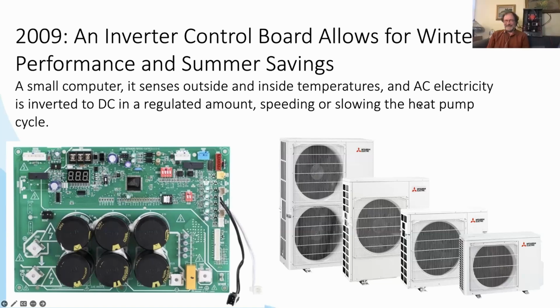There's no reason they need all that hot water. I have a 30-gallon heat pump water heater that was given to me, and I put a low flow 1.5 shower head on it, so great shower. Then I have my tenant living in this tiny house with this 30-gallon water heater. How long could he stay in the shower? For 35 minutes, he still hadn't run out of hot water.